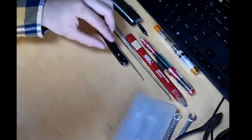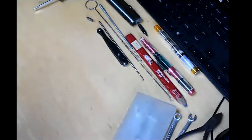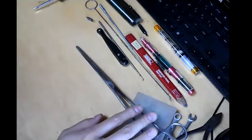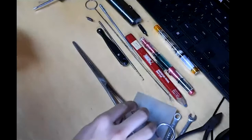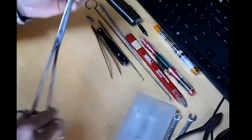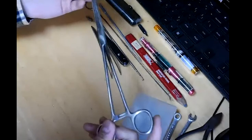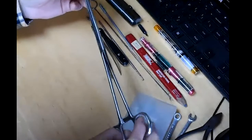The next tool I'd credit to Dwayne Jensen and his endless enlightening tips: a pair of forceps. We like to talk about fixing typewriters as akin to doing surgery, and sometimes it really is. There's a difference between forceps and tweezers — tweezers can be more precise, but forceps lock in and give you further reach with better mechanical advantage. They're great for reaching into small cavities and manipulating tiny parts, especially in IBM Selectrics.